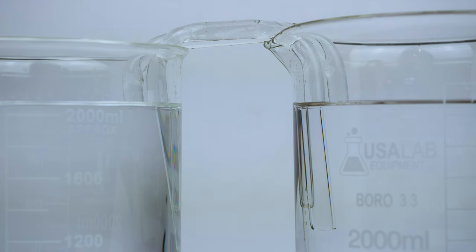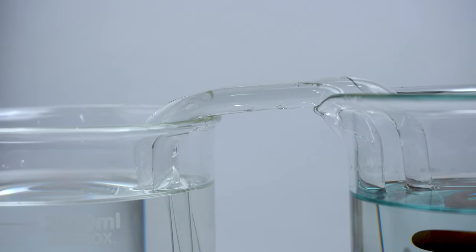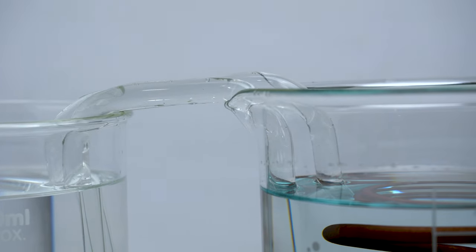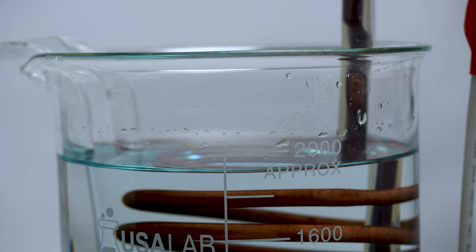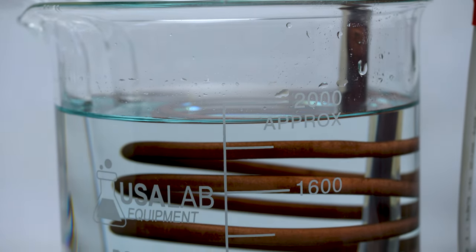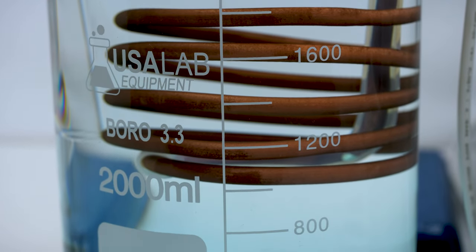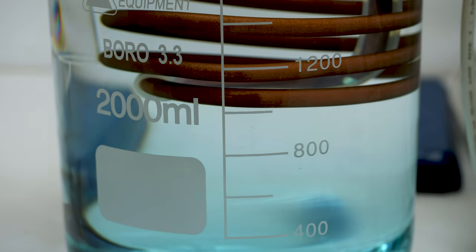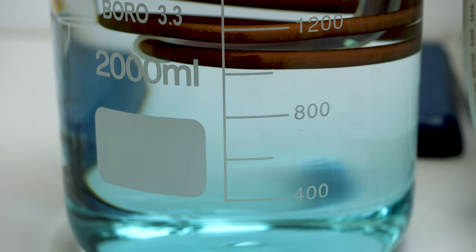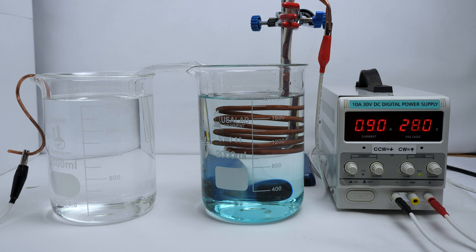The salt bridge consists of bent glass tubing filled with our sulfuric acid electrolyte. This way we still get current flow between the two vessels, but the copper ions will have a much harder time getting to the cathode. Secondly, we ran into problems due to crystal growth on the anode. The anode had to sit at the bottom of the beaker where the copper ions are most heavily concentrated. A benefit to the salt bridge setup is that I can raise the anode to the top of the beaker. This allows for all the solution within the beaker to become saturated with copper ions without the risk of reducing those ions back to solid copper, as a cathode is isolated in a separate vessel.